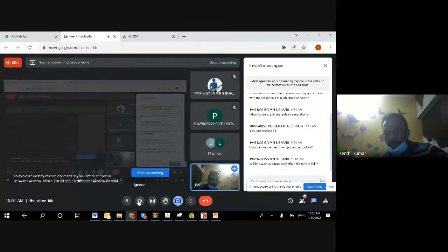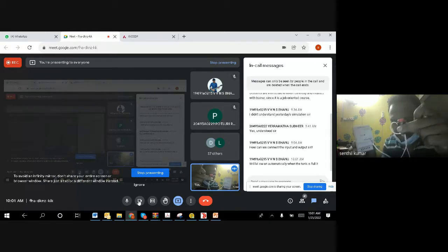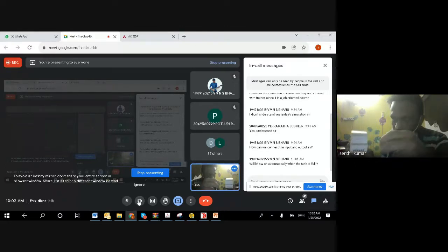Right. So this is the same PLC that you are talking about, right? This is what you are seeing physically there, and I have one push button switch, a red color push button, the same thing we are discussing now. So basically, what happens with this wire: when you push and release, in one wire I give the 24-volt DC input, and when you push it, the other wire goes into the terminal block. You can see the same terminal block.